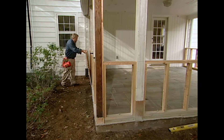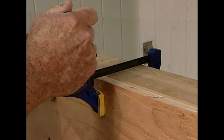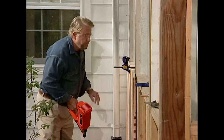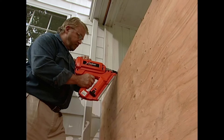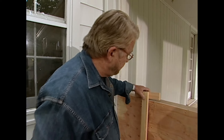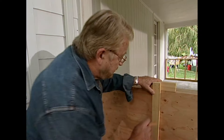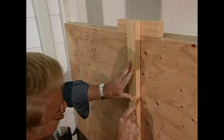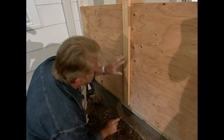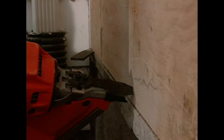Next, I want to begin to actually enclose this by applying plywood sheeting on the outside. I tilt the sheeting up, slide it into position, then attach it with a clamp — this leaves my hands free to work. A couple of nails along the top will hold the plywood in place. This simple T-square I've made up from some scrap 1x2s allows me to quickly draw locator lines for the studs. Even on a short wall like this, it's easy to drift sideways and miss the framing, so the lines make sure every nail finds its mark.